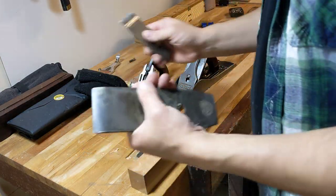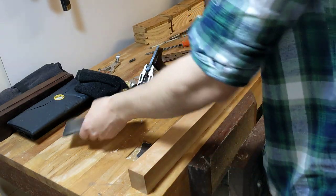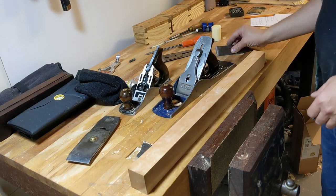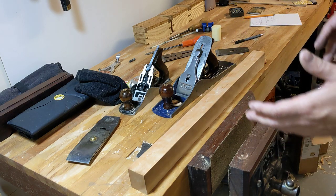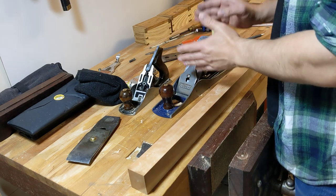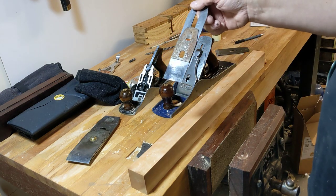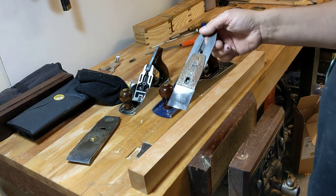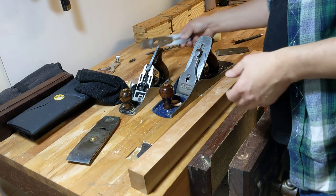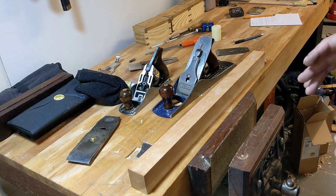So what's the conclusion? Well, you can experiment for yourself, but it's quite clear to see that the cap iron extends the working range of your plane. You don't always want to have it murderously close - you can see it's almost fighting against the plane, it's hard work. But sometimes it's useful to have that facility. You can go for other things like putting a back bevel on a planing iron for more of a scraping cut, or go to scrapers. But it seems strange to tell everybody to just forget about this component. For someone beginning, just keep it back a millimetre and a half, practice on pine, get yourself dialled in. Then afterwards just experiment a little bit - it's not time consuming and it's not difficult. Give it a try.